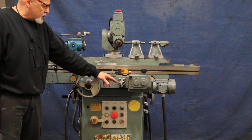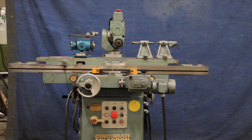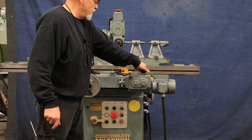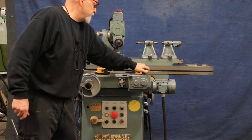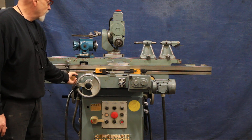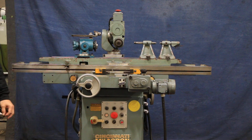To give you an idea, that's 24 inches a minute — right now we're doing 319 inches a minute, so it would be considerably slower with the lower gearing. You can just disengage it from right here and go back to having manual control. So there you have it — that's the Cincinnati No. 2TM Tool and Cutter Grinder. Thank you very much.